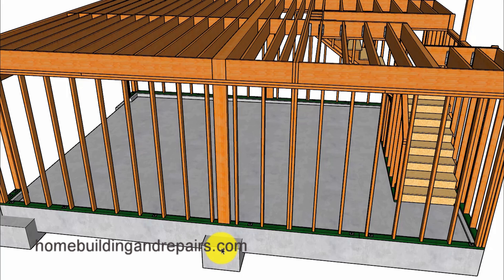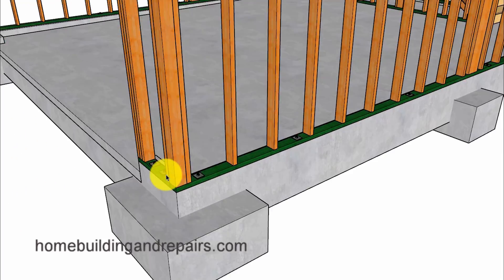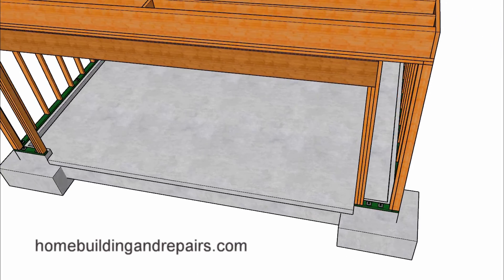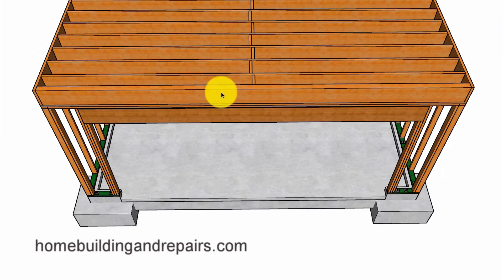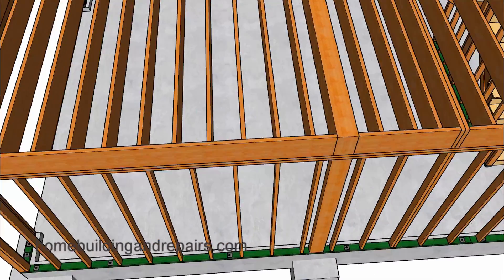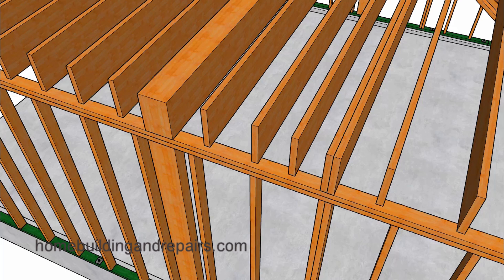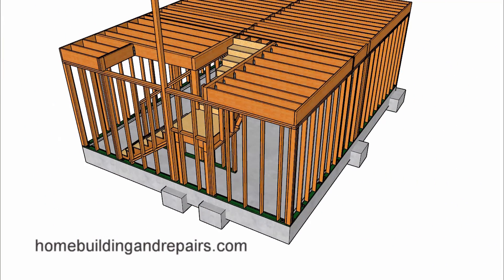This post here will have a footing underneath it. Your engineer might want to beef up the footing here in the same way we have over here and in the front. We have a footing that's going to be a little larger on both sides of the garage because we're going to be transferring the load with a large beam above the garage header. Another change I made was bringing the beam and the doubler out to get full bearing on the top plates, which would look something like this if we remove the rim joist — providing you with another option when building your garage.